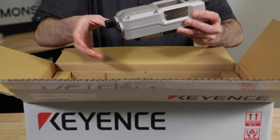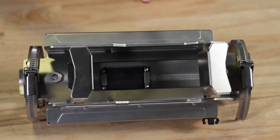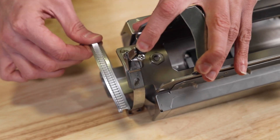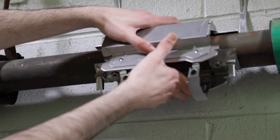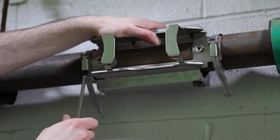Now let's mount one of the larger FDR brackets to a section of piping. In the box, the controller is packaged separately from the bracket. Set the controller aside temporarily. First, flip the two hinged covers open to expose the quick-release clamp screw underneath. Loosen the screws on the upper bracket and flip up the quick-release wings, then pull the straps until they separate from the clamp. Loosen the strap clamps on the bracket, then gently pull the upper bracket and the lower bracket apart. On a clean, smooth section of piping, position the clamp around the pipe and screw the straps back together, then tighten the clamp until it's snug and doesn't spin or slide.